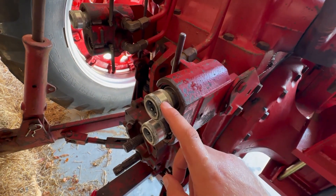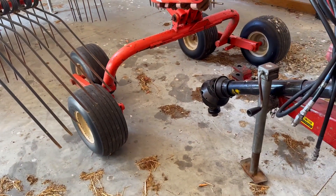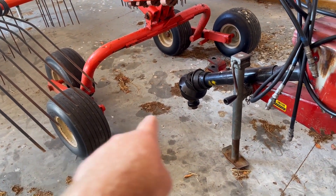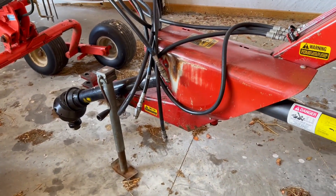These adapters are $30 a piece, which is kind of expensive. For those of you looking to buy a 66 series or an International tractor in general, know that they are not pioneer remotes - you will have to either get adapters or do some converting. A lot of guys on forums just use adapters on all their tractors and don't really care if they leak. I don't like the leaking - when I go to unhook an implement and pull a hose out of that remote they leak everywhere, and this brand new barn floor has tons of leaky spots.